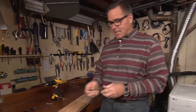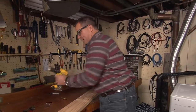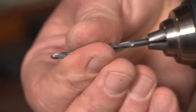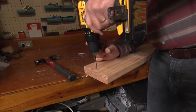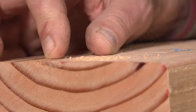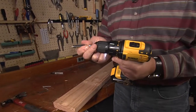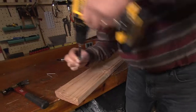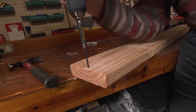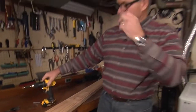If you're using screws, this is another area where you have to be careful, and I recommend that you pre-drill it. Take a drill bit that's slightly smaller than the screws you want to use. If you get onto the end of a board like this, take that cordless drill, pre-drill it, and then use a screw bit. Follow these little tips and the wood will do exactly what you want it to do.